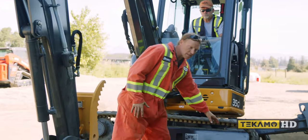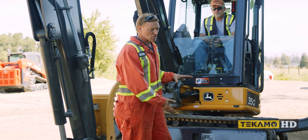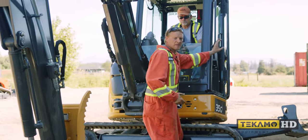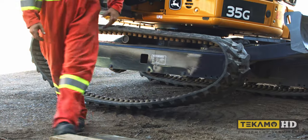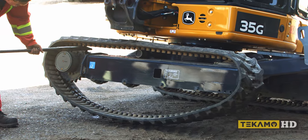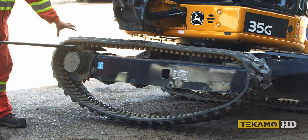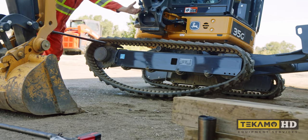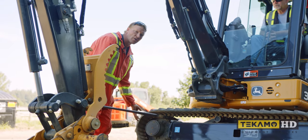As these machines get older, lots of dirt gets piled up inside, and sometimes you'll pull that grease valve out and the track won't move very much. There are two ways to get that track all the way in. One, if you're bigger like myself, you can stand on the track and bounce a little bit — it'll help bring that idler in. The other way is to put your bar in the sprocket, get your operator to fire the machine up, travel the track backwards, and it'll create a gap between the sprocket and track and help bring that track in. We're going to run it around so you can see what it looks like.